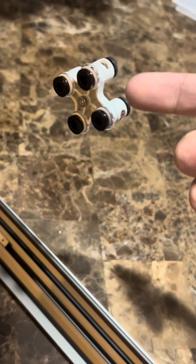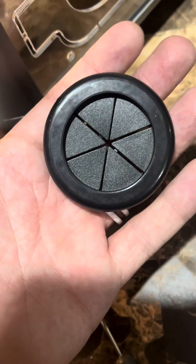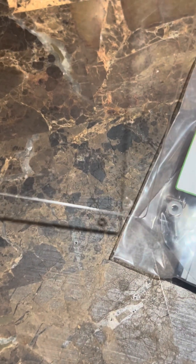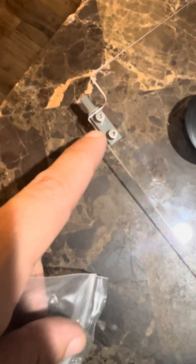You want the two holes to be horizontal. Now we're going to add the filament guide, the spool holder, the TPU channel, and then the wire port — a little silicone piece that pops right in. This goes into the door through a small hole; I had it upside down but flipped it over and it screws in nicely. These are the door handles — they're a bit tricky, using two different screws with a magnet. Use the round screw and the flat head screw for the magnet.